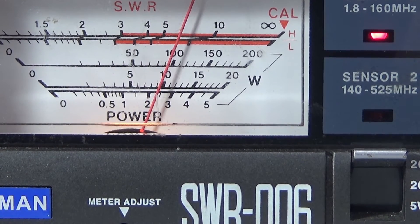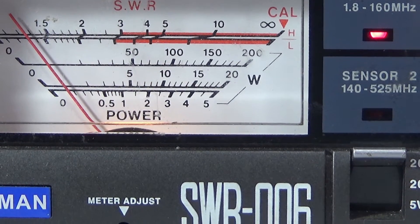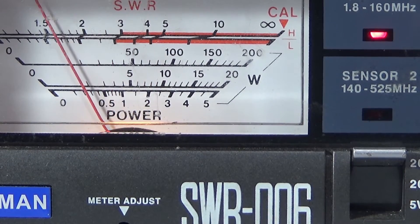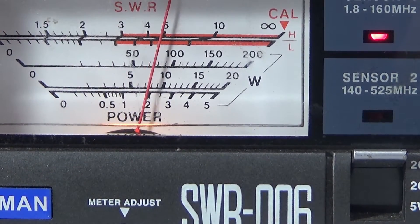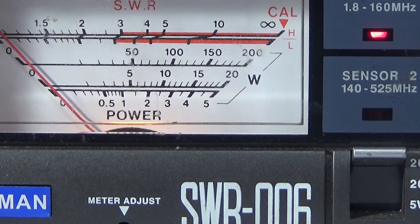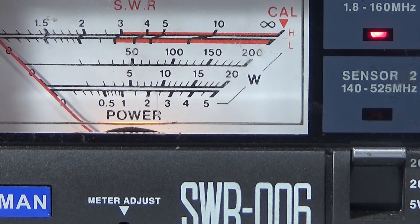At 10 watts input there's about 90 watts; 7 watts input gives about 85; 6 watts input gives around 50 to 70 watts — more than ample. That way you're not overdriving the amplifier, not right on that ragged edge. A lot of these amplifiers have been blown up because people overdrive them and aren't really sure what the output of their rig is — they're just thinking it's about 20 watts.